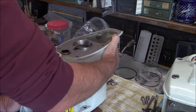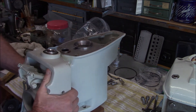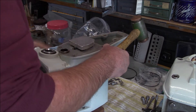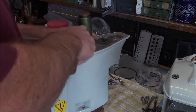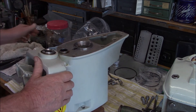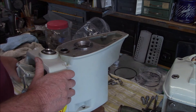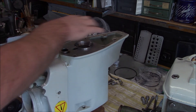Now seating the bearing race all the way — using a block of wood because the return tube sticks out a little bit. I've got a piece of aluminum to bridge that. That's got it. Be sure to clean everything off really well and make sure there are no chips or fragments. If you're using brass, be aware it has a tendency to flake off a little bit. This is now ready to go back on with O-rings, sealer, and so forth — I'll do that off camera.